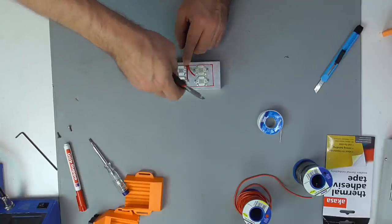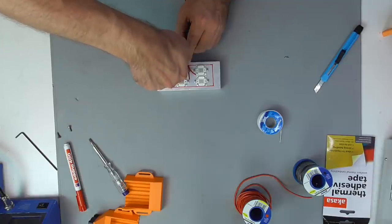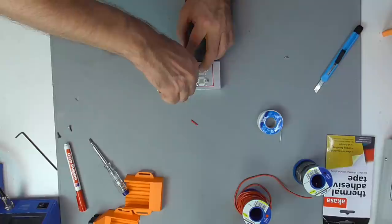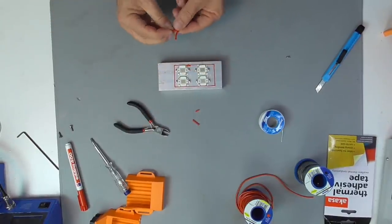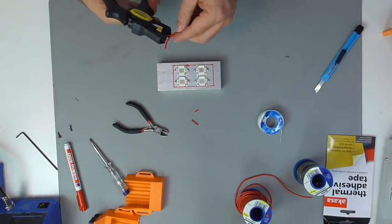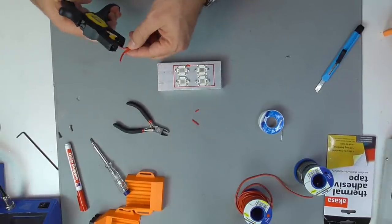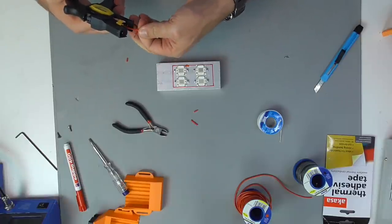As mentioned a couple of times before, the power cable should be attached at the right spot that we marked before. Well, the rest of the wiring is pretty easy. Basically, all we need to do is to connect all the plus poles of all LEDs together and all minus poles of all LEDs together, and to interconnect them with the incoming power cable and their corresponding plus and minus poles.